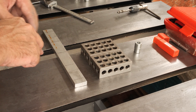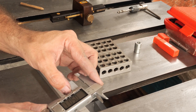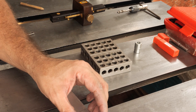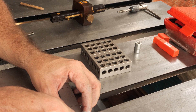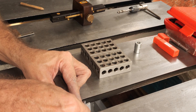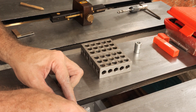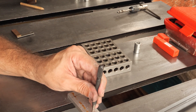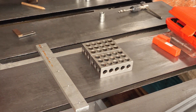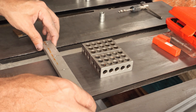Now I'm going to find the center of this bar. I'm going to set the caliper to half inch and lock it. So we have 0.5. I'm marking the holes with the sharp carbide end of the caliper. Now that I have marked my holes in my aluminum bar which will be my self-centering doweling jig, I'm ready to drill.